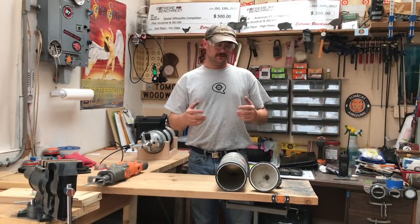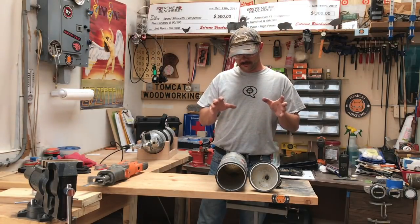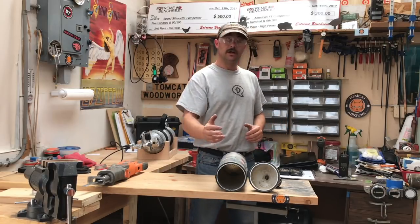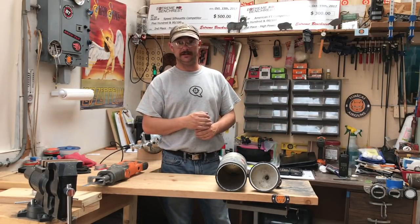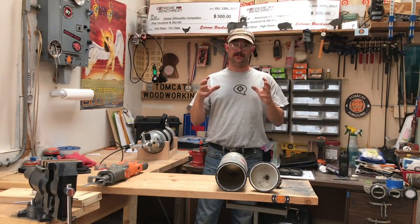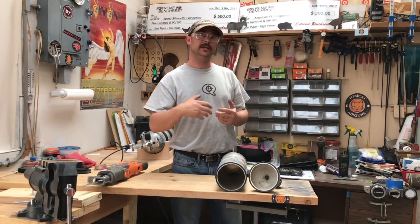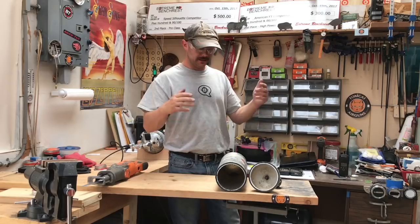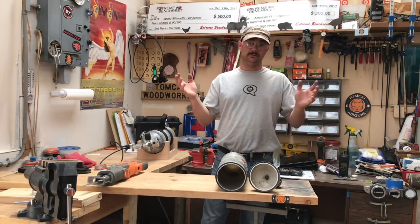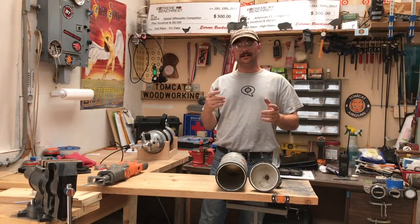From what I've heard — and I found this out directly from the hydro tester — when they hydro test this, they will temporarily and for a very, very short time pressurize these with water up to 7,500 psi. What the guy is looking for is, at that pressure, how much is the bottle expanding, how fast, how much. They take that measurement and determine yes, this passes, or no, this doesn't pass. If they left it at 7,500 psi, it would blow up — that's what I was told — but it is expanding.